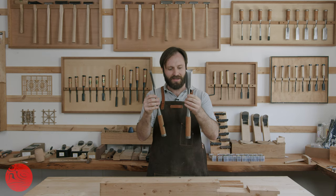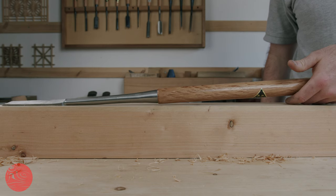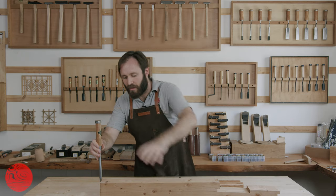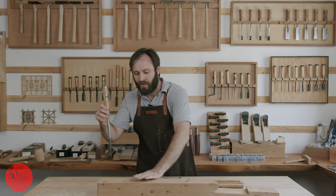These are really beautifully finished examples, and there are a couple of nice things about them. One is that the neck is cranked up above the plane of the bottom of the chisel head, so when you are referencing really big timbers, you can reference all the way past that edge, and even as you work all the way down into a joint, that neck doesn't foul on the timber above.